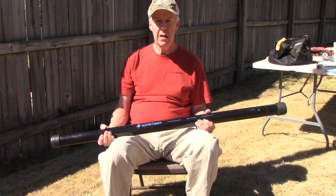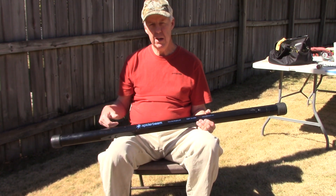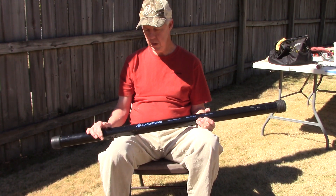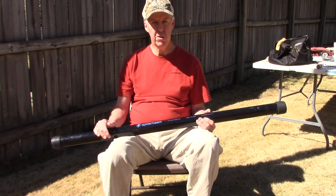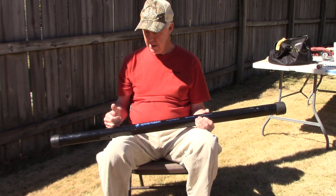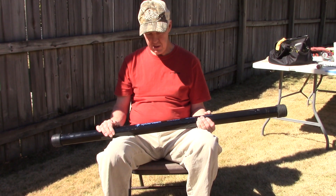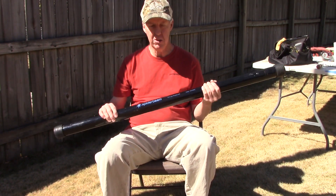You want to think out what kind of antenna — are you going to put a dipole up or an end-fed — and how much length you need, and how portable you're going to go with the antenna. If you're going to use it at home and put up a vertical or an inverted V, it is great for that, especially if you want to get on the 80 meter band and use a lot of that distance going up. Strap it somewhere at the house and use it — great in the HOAs.